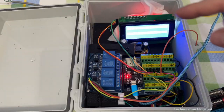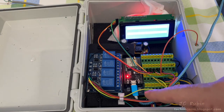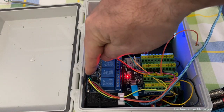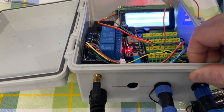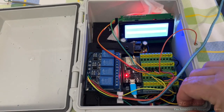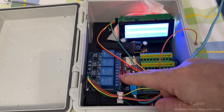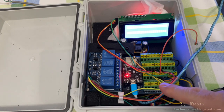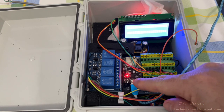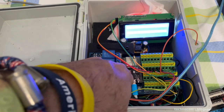I dropped the main board back in to recheck fitment. I picked up an ESP32 Dev Kit C that fits the breakout board — I got this one from Mouser and it has an external antenna, with a wire that wraps around it. I wanted an external antenna because I didn't know how an onboard antenna would perform when the box is closed with all this wiring above it. The small antenna comes out the bottom as shown. All the top-side wiring is just temporary to make sure everything's working before I put the permanent wiring in.